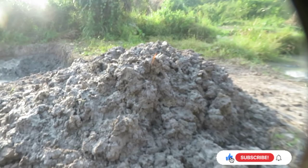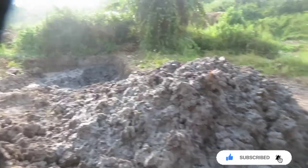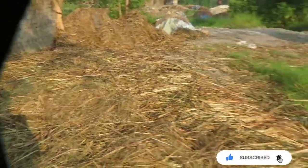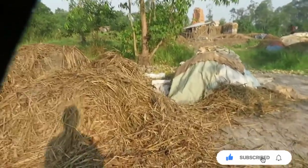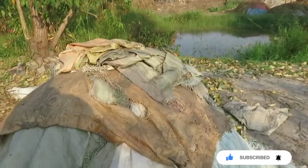Now, contrary to what we think, clay bricks don't love water. They only love water in the process of making them. Once you make them, they place them flat like this on the ground. These things are actually for buying too. At this stage, you need polythene, or sack cloths like a sack like this. All these things you must buy. These are the best for covering at that stage.